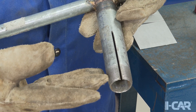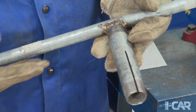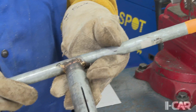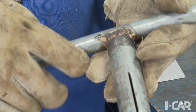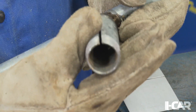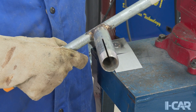This is one-inch plumbing pipe, about six to eight inches long, whatever's going to work for you. Our handle is made out of half-inch plumbing pipe, about 18 to 24 inches — whatever you want for leverage. We braced them together right here, and it works out really well. It gives us plenty of leverage, and it's about the right diameter so that when we're rolling the coupons, we can get those to peel apart really nicely.